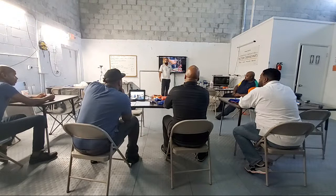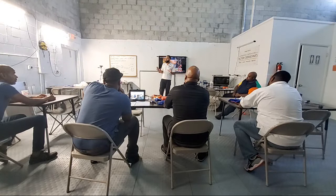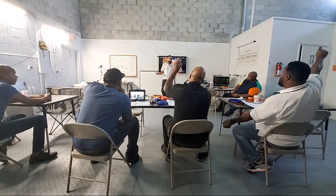Condenser fan. And you want to hear that? Condenser fan motor. We spoke on Monday about condenser fan motors, how to test them. Remember we showed the schematic? Remember we said some of your condenser motors are going to run with VDC or VAC. They're going to be either 120 volts AC or 5 to 12 DC. I gave you a little trick to kind of tell what fan you deal with. Does anyone remember? You read on the actual fan itself, what it has.